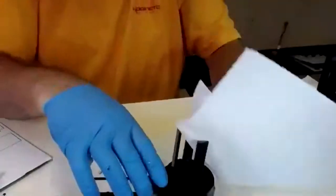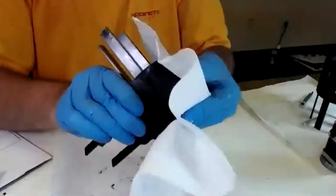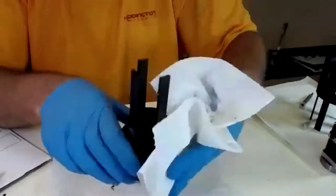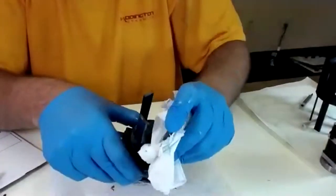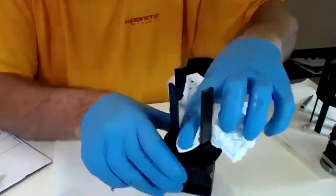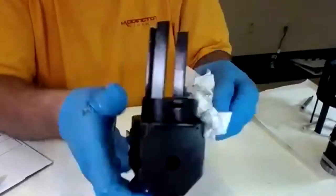And this is a good time to wipe this piece down because of those ports to let that glue out. Make sure you absolutely clean off the strakes because we're going to be sliding other components on top of them. And where I miss is always inside here, those inside edges. The more cleaning you do now, the less swearing you do later.